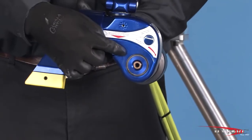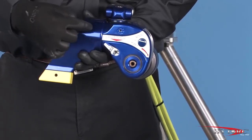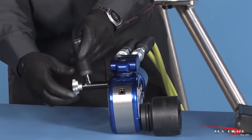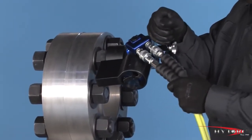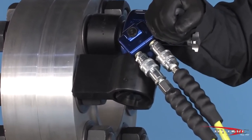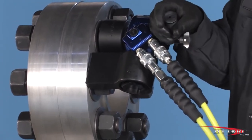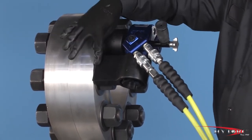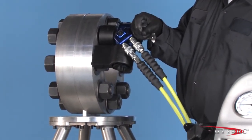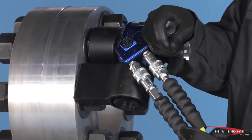Since the drive is offset from the piston inside the tool, when viewed from above the socket, the advancing piston will turn the drive and socket clockwise, tightening the nut. Attach the safety handle to avoid any pinch danger. Place the tool on the application, checking to make sure that the reaction point is secure, the wrench is fully engaged, and the hoses are not in danger of being kinked or damaged. Note that the reaction arm should be rotated so that it rests against an adjacent nut in the same plane as the nut to be tightened. It is a good idea to bump the control button before starting to tighten, just to check how the wrench will react under pressure.